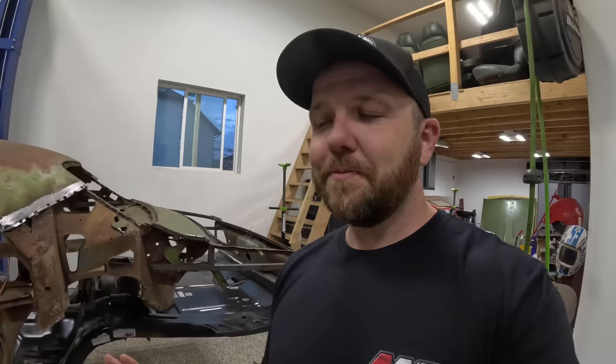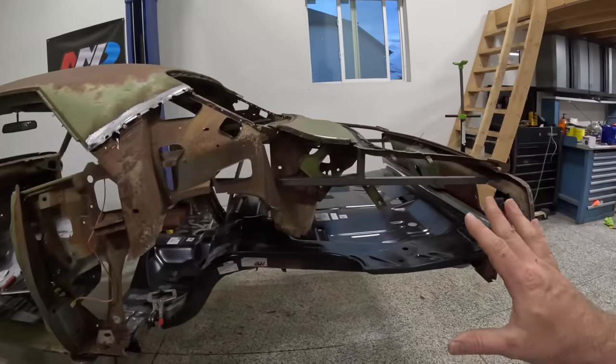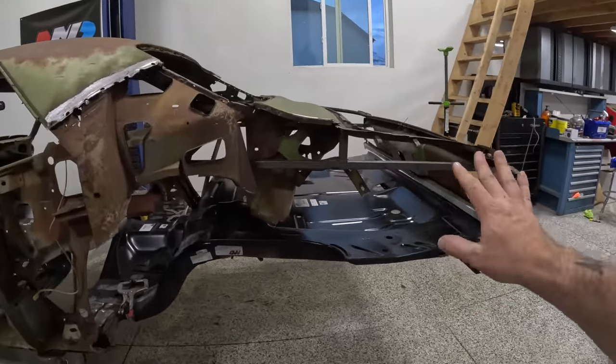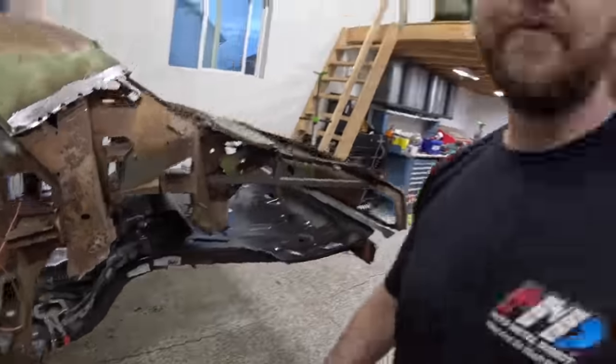So the next video, we're gonna have to go ahead and test fit the inner and outer wheelhouses, make sure those are where they need to be, get them screwed into place, the same with the rear quarters, and we're gonna position the tail panel so that way we can weld it permanently to the trunk pan once that's all done. So there is a process to this. I promise there's a method to my madness here.